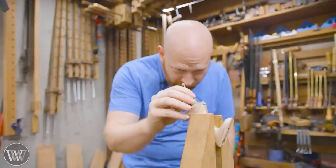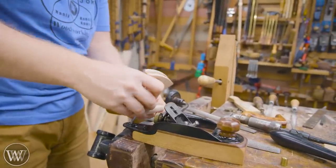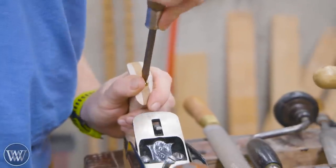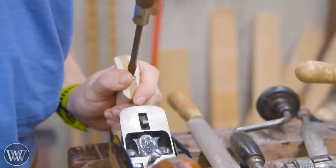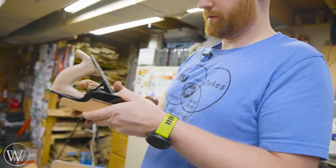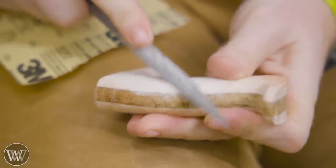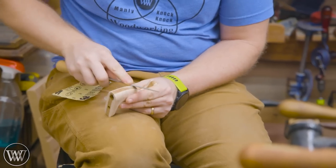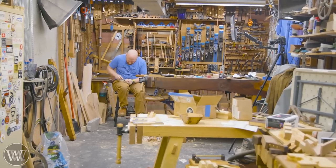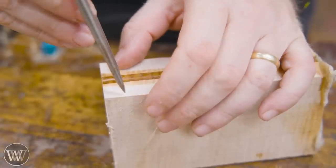I wanted the insert for the brass ferrule to be very tight, so I left final adjustments until it was all ready to go in. Using a depth gauge let me know whether I needed to go a little more — or, oops, I went too far. Always take off too little until it's too late and then start over. The threaded bolt was ever so slightly short and I had to work on it a little bit. I'll come back later and smooth out the top of the tote and bring it down flush with the brass insert. I'm bringing in a bow sander — it shows imperfections because the dust fills in different places — so I use my finest file and 400-grit sandpaper, spending a good while at this to make it really nice and smooth before finish.